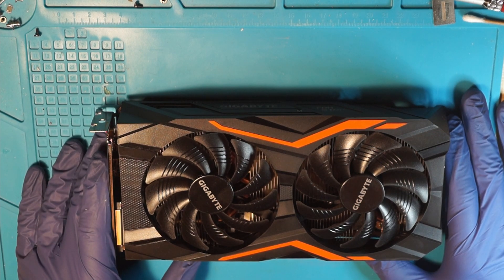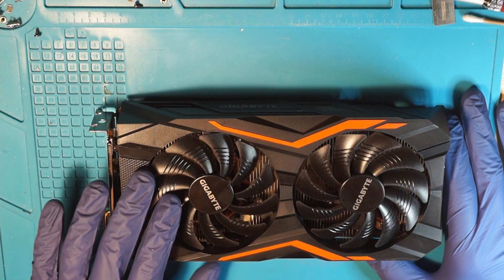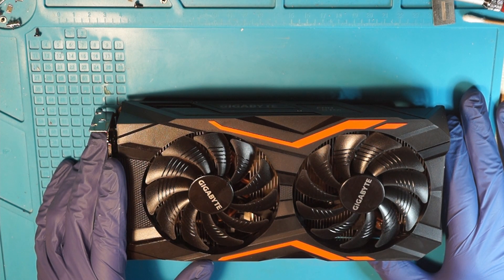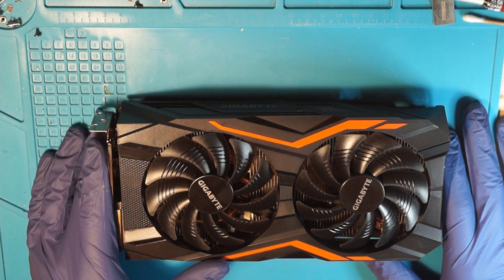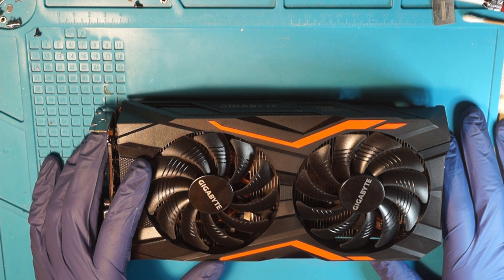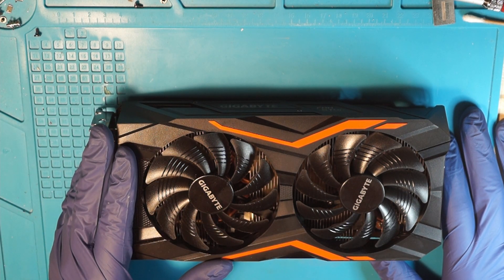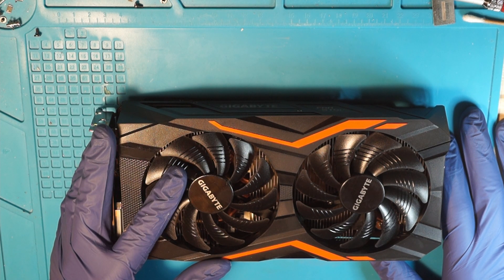Right now it has 2GB of VRAM and my idea is to upgrade this to 4GB, basically to the same amount of memory that a 1050 Ti has. Now if you remember the upgrade video on the RX 480 that I did some time ago, the upgrade process is straightforward — you replace the chips, flash a new BIOS, and the memory is detected. Nvidia cards aren't that easy.